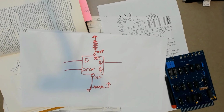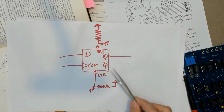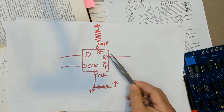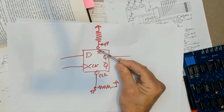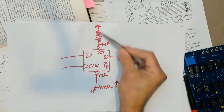Well, in this video, this is a follow-up where we're going to talk about that very topic, meaning including a resistor in a fixed input specifically for testing or diagnosing the circuit. In this sketch of a flip-flop, for example, the preset and the clear are both tied high through resistors. And this allows you to come back to a fully populated board, and with a jumper you can just take either of these pins low if you feel the urge to manually force either a set or a reset of that latch. And of course you can only do that because this resistor is in place.